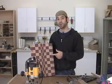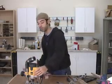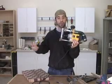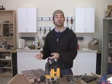A big board like this one can be difficult to handle sometimes, so we need to make it easier to pick up. I like to use a router with a straight bit to actually create recesses in each end for your fingers. The dimensions of these recesses aren't really critical — you just need them to be big enough so that a few fingers can fit underneath.